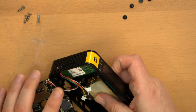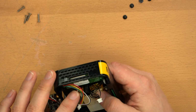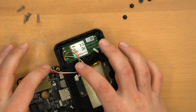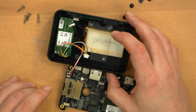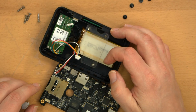Now, fortunately, I could see the circuit board at the end of this battery, so the overcharge protection and over-discharge protection should be built into the cell itself, or into the end of the cell. So if I short these out while soldering them, it should not cause the battery to melt down. That is the hope. My other option is, of course, to clip these cables, and then later, if I want to reuse this as a portable device, splice them back in.